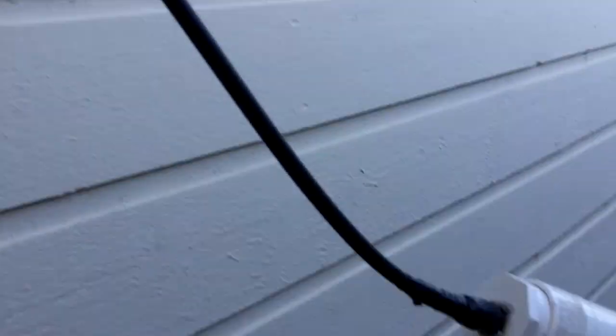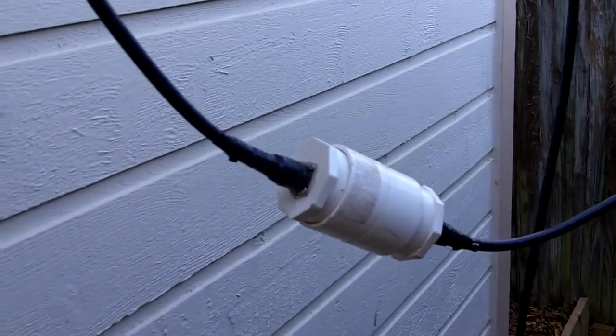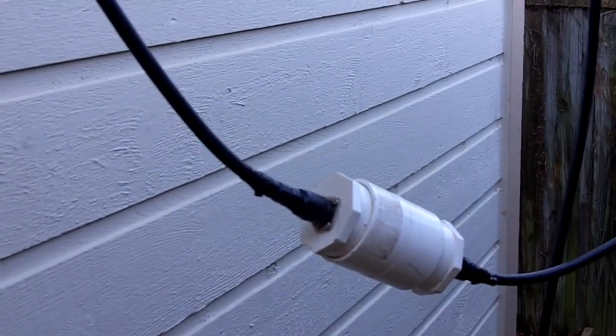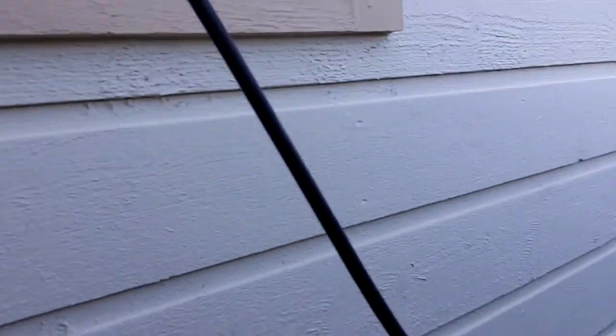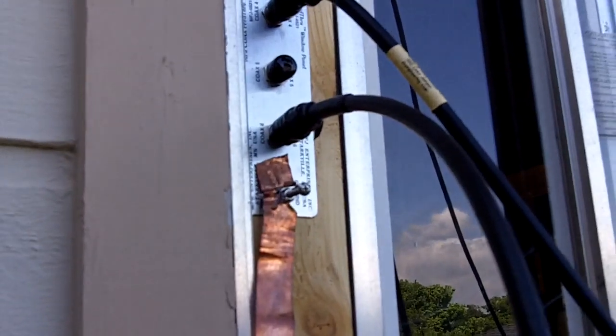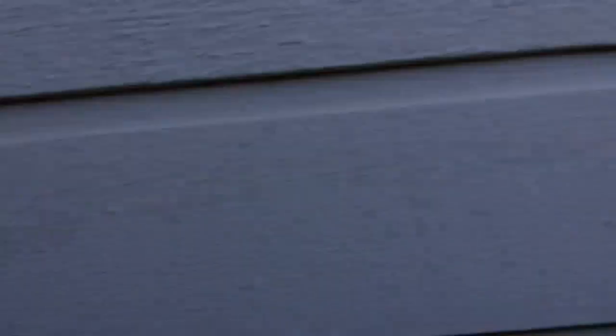Basically got a really good ground here, and choking out that long wire to cut out the common mode currents that may be coming in. We've got a nice choke on it right there and then it goes through the MFJ pass-through right there to the inside of the shack.